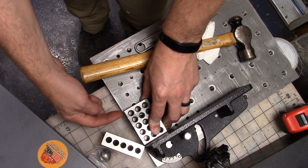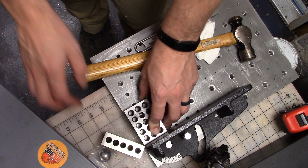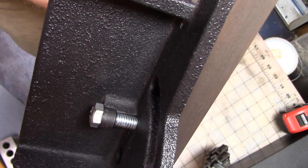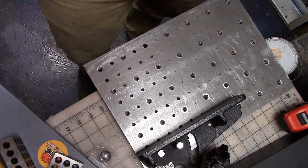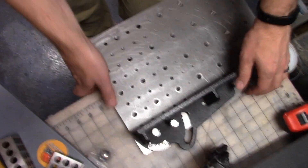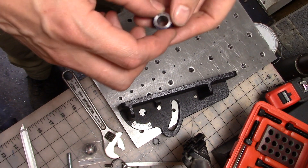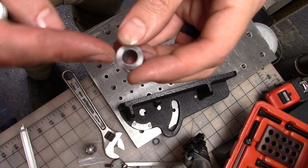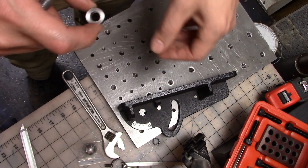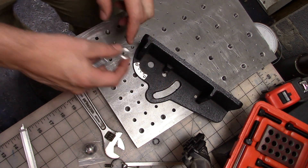Yeah, see — it's rotated, which I think is just because of the shape of the collar. You can see how that's probably tweaking everything this way. So I'm going to have to fire up the lathe and make a custom washer that actually bears all the way around. Okay, so what we've got just goes all the way through — next I'm going to cut off this side basically, so it'll butt up against there without making an offset.